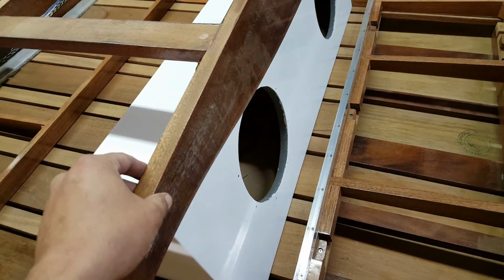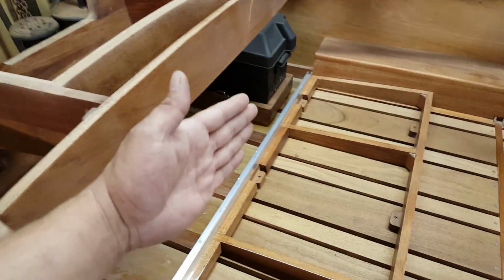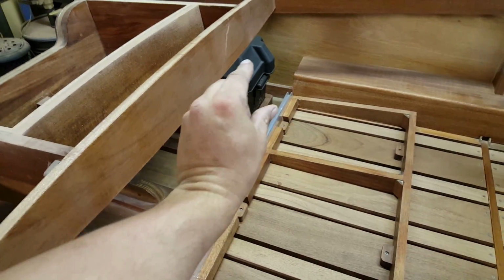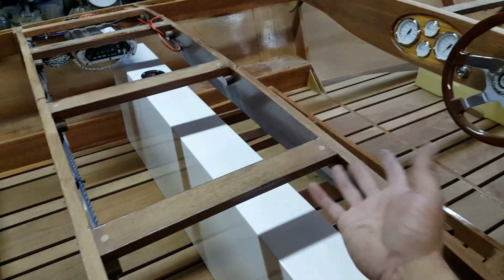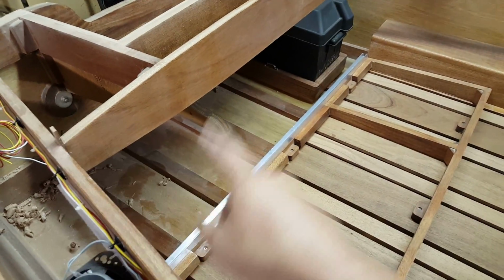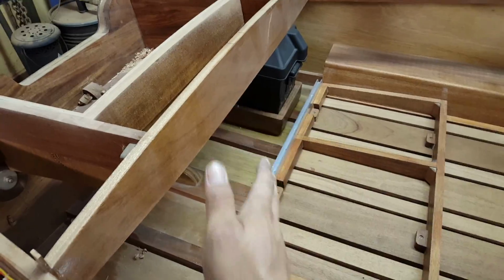And then we'll do the same thing with T-nuts and stainless bolts to hold the top of the front cockpit seat back. So T-nuts in the ply with a bolt from the back side and a washer to hold the front seat on. The back seat will be a little different. It'll still drop in that channel just the same, but I'll run a 2-inch wide piece of Velcro all the way across this frame and all the way across this frame, because you will access this area quite a bit more often than you'll need to get behind the front seat. To get in here and mop up bilge water or do any kind of wiring or whatever the case, get to the battery. So this seat will basically drop in and then Velcro in place. And if you need out, you just pull that seat ahead, slip it out.